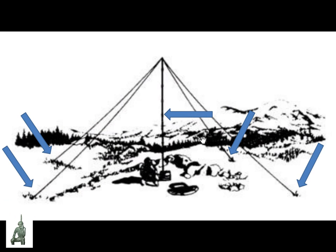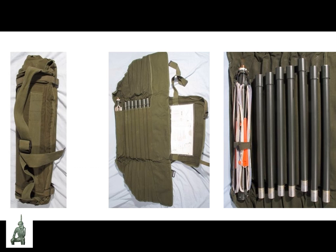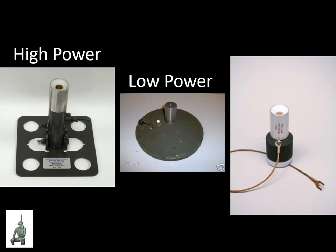Going back to that old Army manual — you see a soldier kneeling down on the radio with the AS-2259/GR NVIS antenna, with the sections where they plug in and the dipole leads coming off the side that also form the guy wires for the mast. If you're looking to buy a NVIS antenna, you can find them online — I'll put the part number AS-2259/GR down in the description. This is what it should look like when you get it: seven sections, a masthead with the antenna elements, and a carrying bag. One important thing to look for is the type of base plate that comes with it — make sure it has a base plate, or you'll need to buy one separately. There are three common base plates for the military version of this antenna.